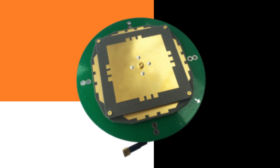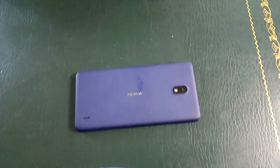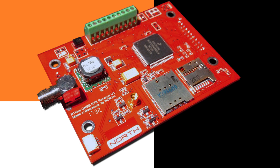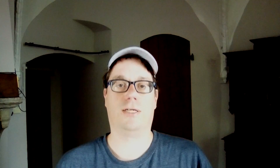In GNSS receivers, they use big antennas. The bigger an antenna, the more satellite signals can be received. Seeing the size of the phone, you can know for sure that the GPS antenna in the phone is much smaller than the antenna in a professional GNSS receiver. The other thing is that a phone does not have an RTK module — it has a GPS receiver which can calculate the position globally, but that does not work with the corrections needed to determine an exact position. So you should not start to land survey with just a phone, because your accuracy will be very low.